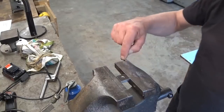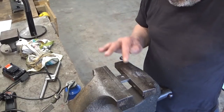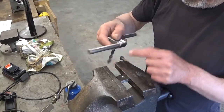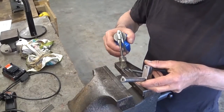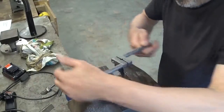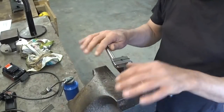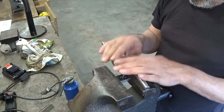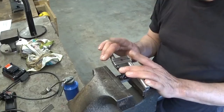Let's put it to the test. This is a piece of hot rolled steel. I drilled a hole in it, 8.5 millimeters. Of course, I wanted to do it in the drill press, but this tap handle is too big. It's going to touch the column, so I do it here. We're through. You're right, Cam. These are great taps. Thank you very much. Of course, there's a link to Cam's channel in the description.